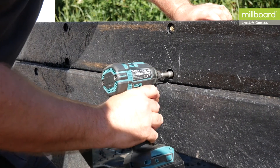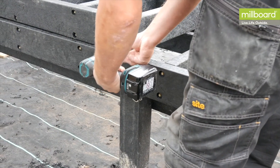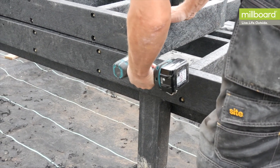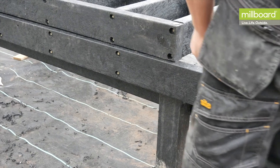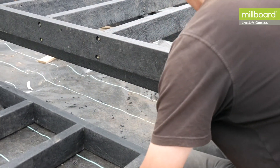The steps are built by constructing an outer frame first and inserting joists along at the appropriate intervals. These frames are then attached to the posts in the ground. The weight of these frames can be heavy, so it may be worth having someone assist at this point.